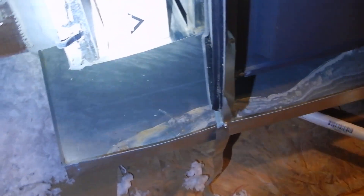Coming over here, this is where our air filter is. It's time to change your air filter. We crawl up here — be careful, there is no room, it takes some acrobatics. We have these suitcase buckles. The filter is 4 by 20 by 25. Slide a new filter in there just as easy as that, readjust your buckles, and you're fine.